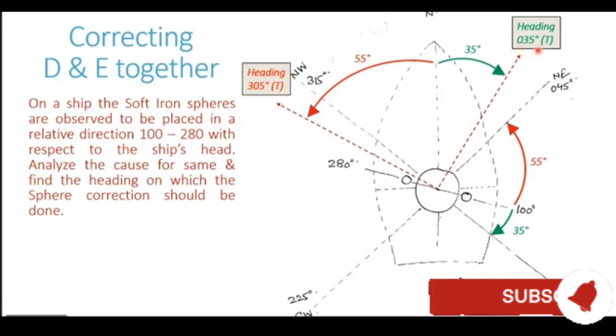So we have obtained two options. One is heading 035, the second one is heading 305. Now if you look carefully, even if the ship goes on a heading which is reciprocal of 035, reciprocal of 035 would be 215. Even on that heading, the spheres will be lying at an intercardinal direction. You see, at 035 heading, the starboard sphere was southeast of the compass. When the ship goes to 215 heading, reciprocally opposite heading, this starboard sphere will go to northwest of the compass, reciprocally opposite direction. So the correction is also possible when the ship is heading 215,